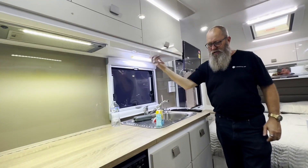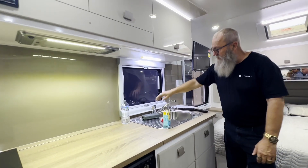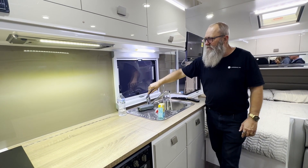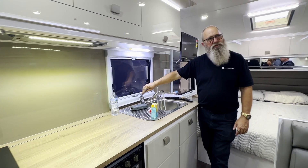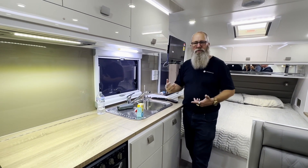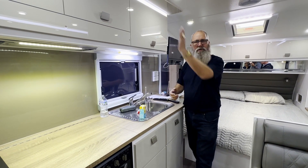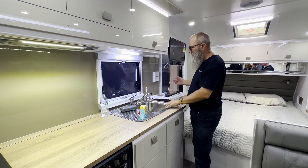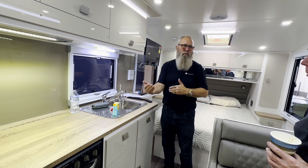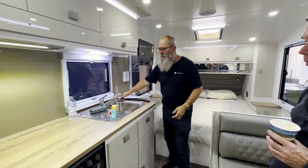There's a light over the bench with a little push button in the centre. Standard household tap here. If you get spluttering in the taps, the only way to get it out is to run them through — that gets the air out of the lines. If you get air in the lines, you've got to go through every tap: shower, vanity, kitchen, filter tap, and the one on the draw bar. Otherwise you'll get water hammer and the pump will be really loud.